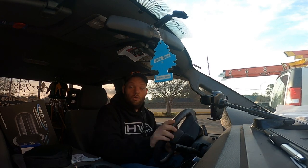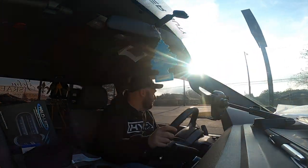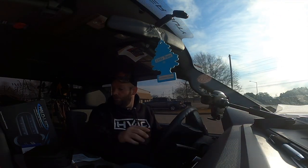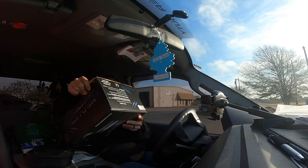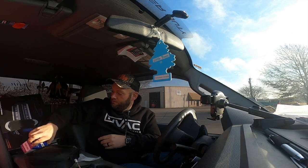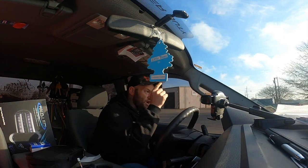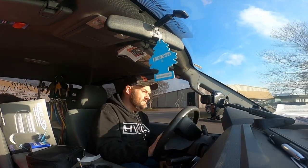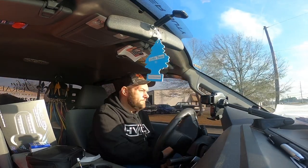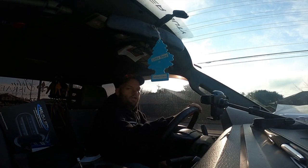Good morning guys, it's January 9th, Monday morning. We got a Reme Halo right here — it's actually a Reme LED, he went with the better one. We've got a 40 VA transformer to power it. I see a lot of guys that power those things off the transformer that's already in the unit — don't do that. These Reme units stay on all the time, they don't cut on and off, so they need their own transformer.